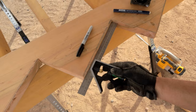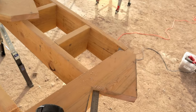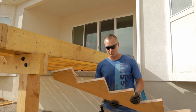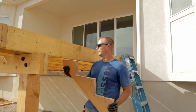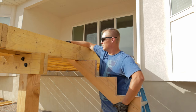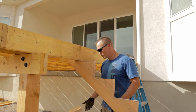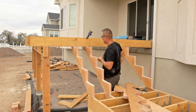Now we're going to figure out how to attach our stringers to the deck. You can see each one has a 10-inch run, but on the end one I've got an 11 and a half inch run — that extra inch and a half is what tucks underneath the deck. I added that extra one and a half inches on the end of the run, and these two fit right in between. I could screw in from the face or from the back side, and I'd add extra blocking to each side as well. Just like your joists, the stringers will need to be 12 inches on center to properly support your composite deck material.